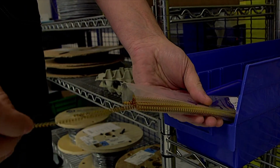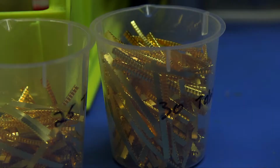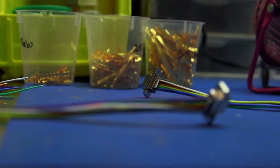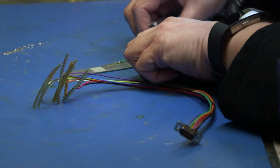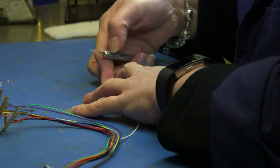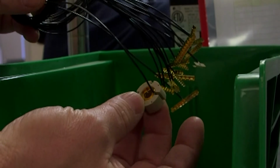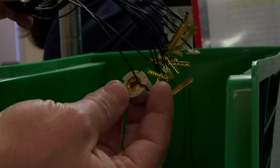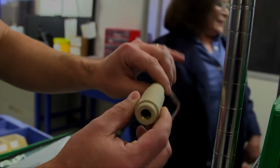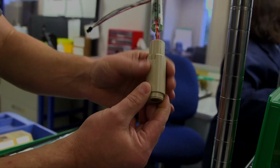For the female side of the connector, the process starts by pre-cutting the color-coded wires, then attaching them to a leaf spring. The strip is cut to size with a certain number of leaves on that strip in relation to the conductor ring it will fit into. This strip becomes the conductor ring that is attached to the isolator ring. These are then stacked together, and the body of the female slides over the assembly and lines everything up internally.